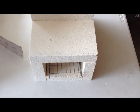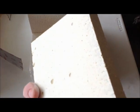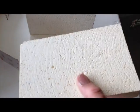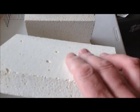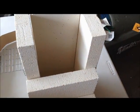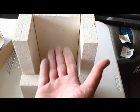I've got one set up outside that we're going to go use. The reason these are so great is because this is insulated fire brick — it's ten times more insulated than regular fire brick. This is an inch and a quarter equivalent to about ten inches of regular fire brick as far as the insulating properties. This is what you want for a rocket stove. You're going to load the wood in here and you want all the heat to come up through this flue.